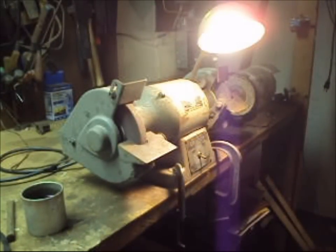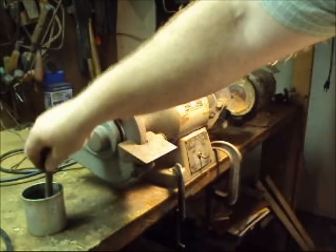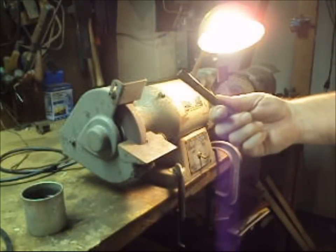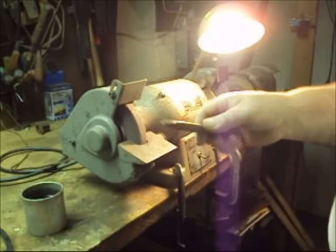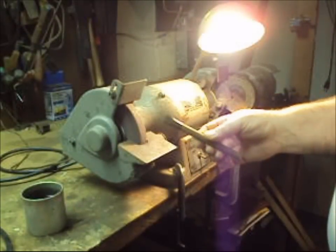That's awfully fast. I don't think I could catch a rock coming at my head from this close if it was released at 60 miles an hour. We also need to have some water nearby. Everything we grind on this wheel is going to get hot — you'll see all the red hot sparks coming off the wheel, and all that heat is being transmitted into the part. We don't want to burn ourselves, and we don't want to take the temper out of the chisel as we're grinding it.